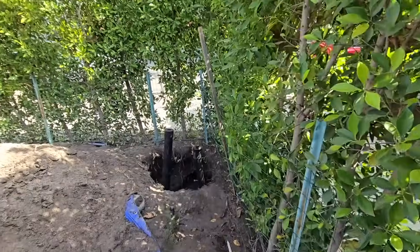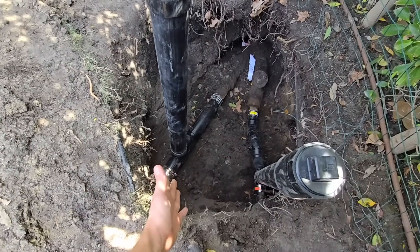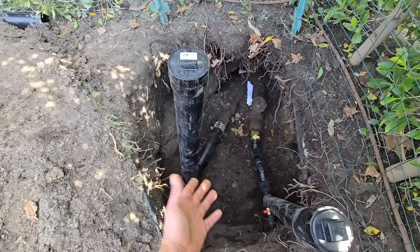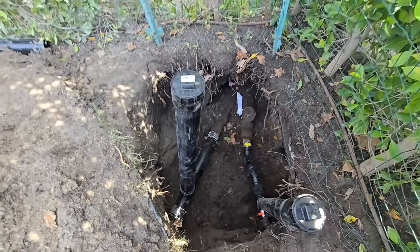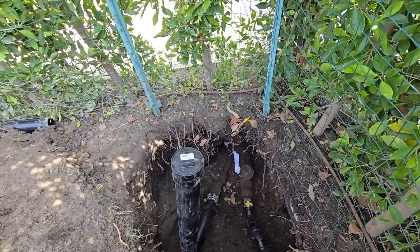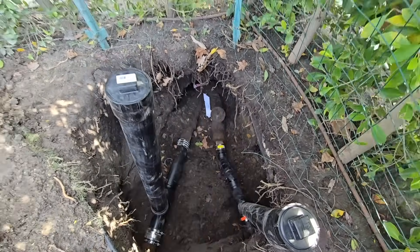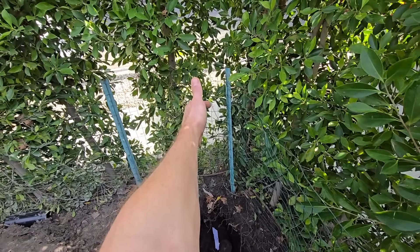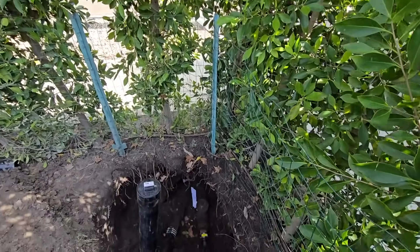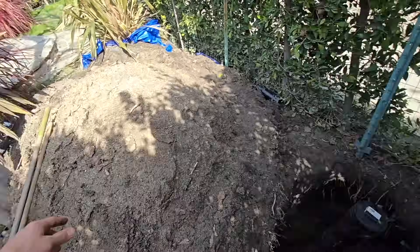There's been a lot of repairs that have had to happen over here. We just tied it on — we had to use a Husky down there for a multitude of reasons — but this is gonna have to get dug back up and they're gonna have to replace all this out to the street. I don't know if I showed this in past episodes, but you can see the Y right here — there's a massive root intrusion that I'm going to chain out today or tomorrow, right by the sidewalk. It's just not good. The house sewer runs all the way back — it's garbage, dude.